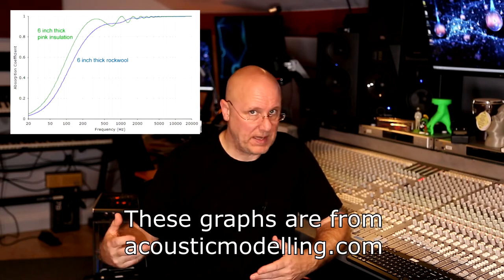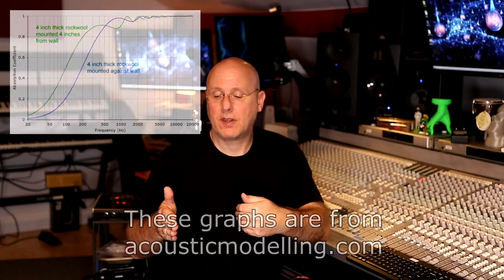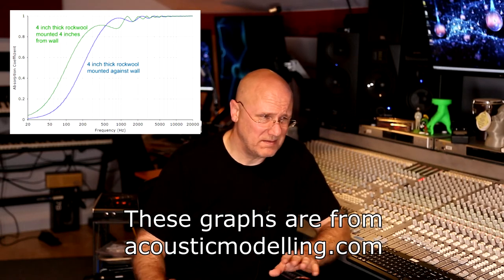Then I built a bunch of panels. For the larger traps I made those out of pink fluffy insulation — just Owens Corning something or other. After you get past about six inches in depth, rock wool isn't as effective and the pink fluffy stuff is more effective. So that's what I used in those. I made them 16 inches deep because I bought 16-inch wide pink insulation, so it saved me from cutting it up very much. There are some online calculators and I'll leave a link in the description to one I like. It gives you basically: if your trap is this deep, these are the frequencies it can stop; if you mount it away from the wall a particular distance, this is how much more effective it is. I'm not going to get very deep into that because there are a lot of other videos that discuss this.